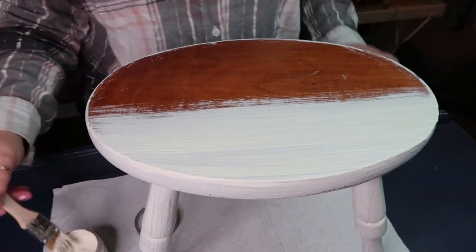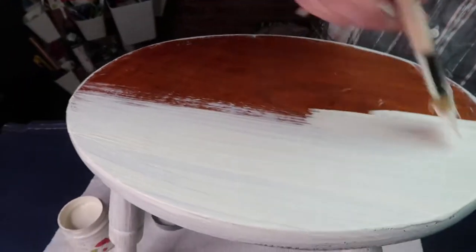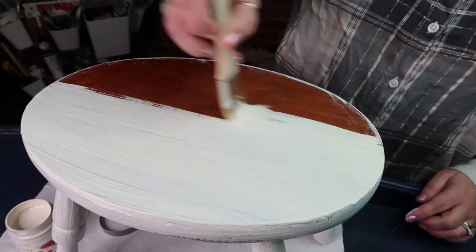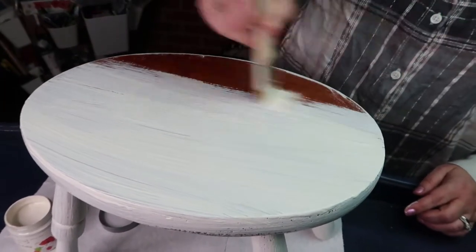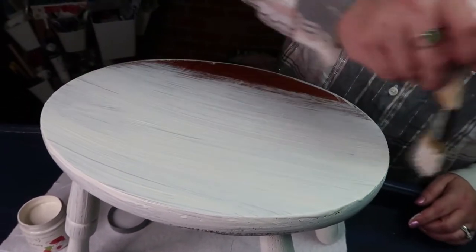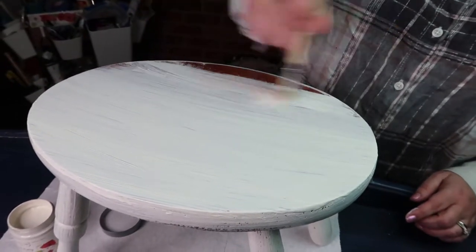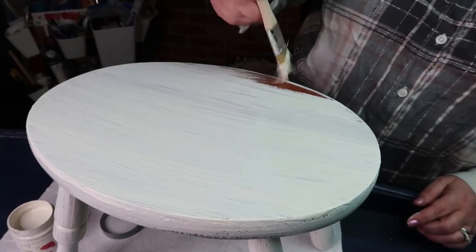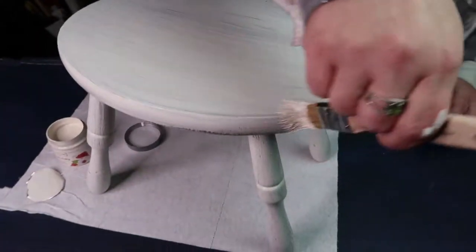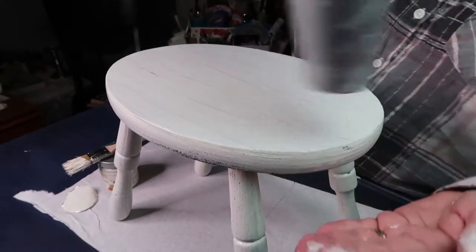Go with the grain, as you can see here — it goes the long way, or you can look down the center of the grain to see which way it goes. Make sure you paint that way. Don't use quick, snappy strokes that will build up the paint and give you more to sand — it doesn't leave an even coat. You can use a little bit more on the top, but you don't want to use too much because those drips are never fun. It's just going to create more work for yourself.